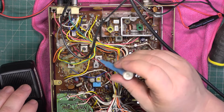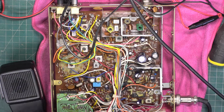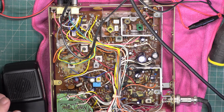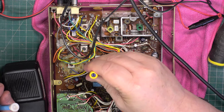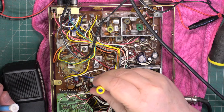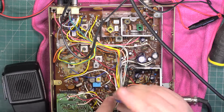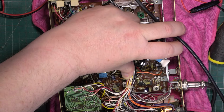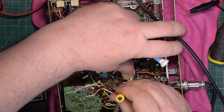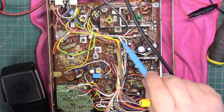Get the extra circuit on these, which you don't get on the Rotel 220, which is to do with selectivity, otherwise known as bleed over. So we're going to move on to the IFs now, the intermediate frequency coils. Just put a bit more signal on, not enough to saturate, but just a bit more signal. That's spot on. Spot on. There's one under this wiring somewhere. Peekaboo. Spot on anyway. So, the only one which was started out was that.